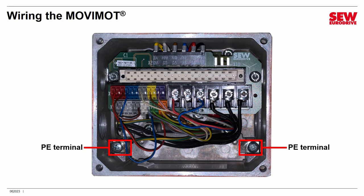There is one additional connector on the circuit board that wasn't visible in the previous slide. It's the X10 connector. If you're using the BES or BEM brake controller, it has some connections which would attach here, and it would also make some connections to the 13, 14, and 15 terminals as well. So that takes care of the remaining connections in the conduit box.